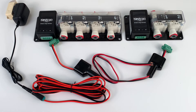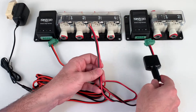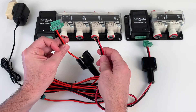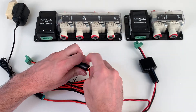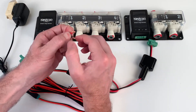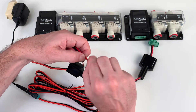If you have just a single keg monitor, you can skip this section. What we're going to do is connect a second keg monitor to the same power source as the first. Build the same power cable assembly as in step one. This time, instead of connecting the wires to a power adapter, we're going to share the power terminal from the first keg monitor. Before connecting, feed those wires through the cable shroud and smooth them out so they'll fit into the terminals, then give them a nice twist.